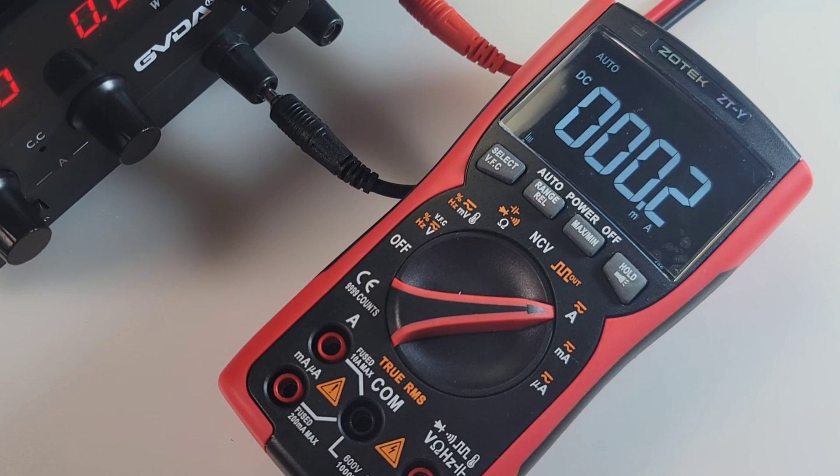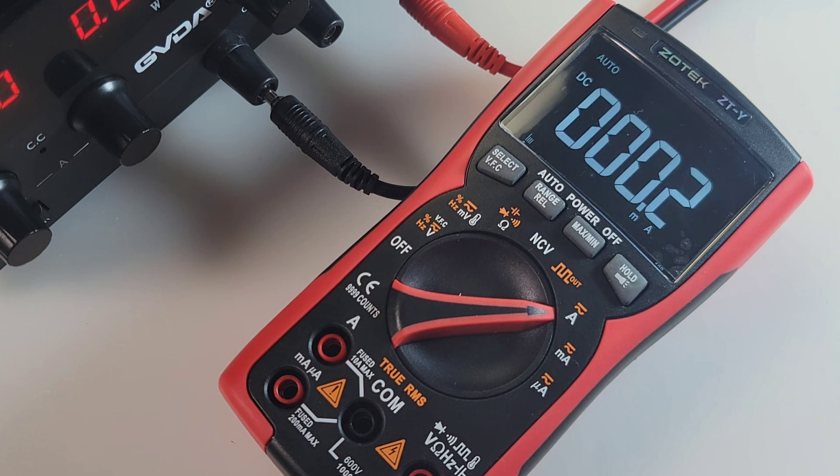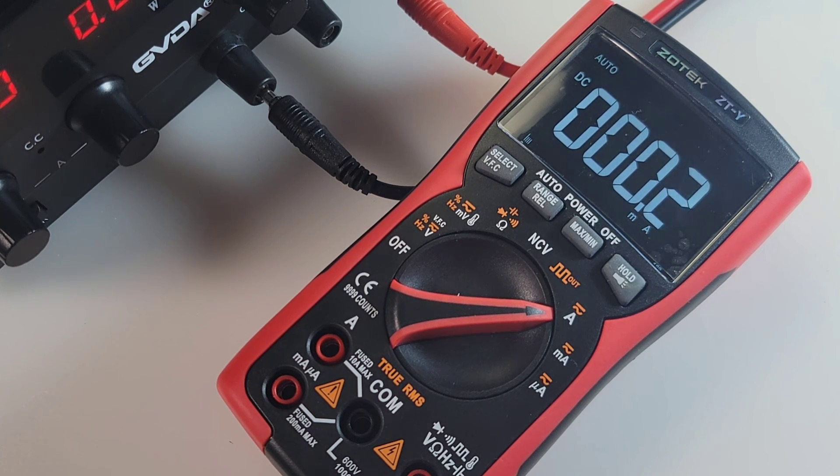When you're in current mode, you're going to get a beep — an audible beep that comes around every 10 seconds or so. It's just letting you know that yes, you are in current mode. AC or DC current, doesn't matter — you're going to get the beep. It doesn't go off. It can be a little irritating and some people have complained, but honestly it doesn't bother me. I think it's kind of a neat little safety feature.